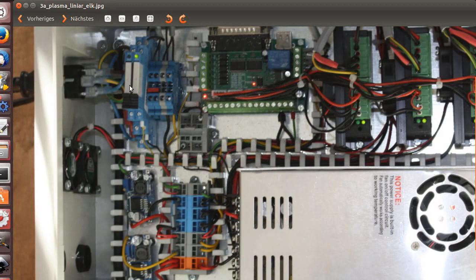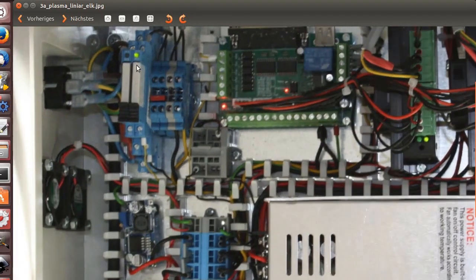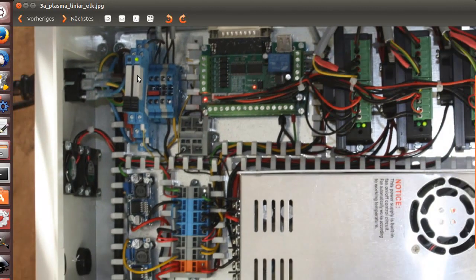I have 2 relays set up for the inputs of the switches. I like to run through a relay system. As you see, it's negative logic, so the switches take the power off. Negative logic should be preferred.